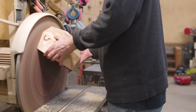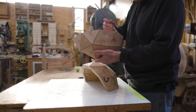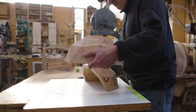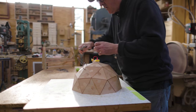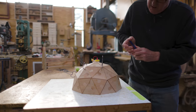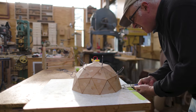You can see a little dark U-shape on one of the triangles here — I had a problem where the Z-axis fell for some reason and the collet of the router was riding on the wood. Luckily I was right there and I could stop it. I'm not sure why it did that, whether something slipped or something was screwed up in the G-code, but it only happened once.